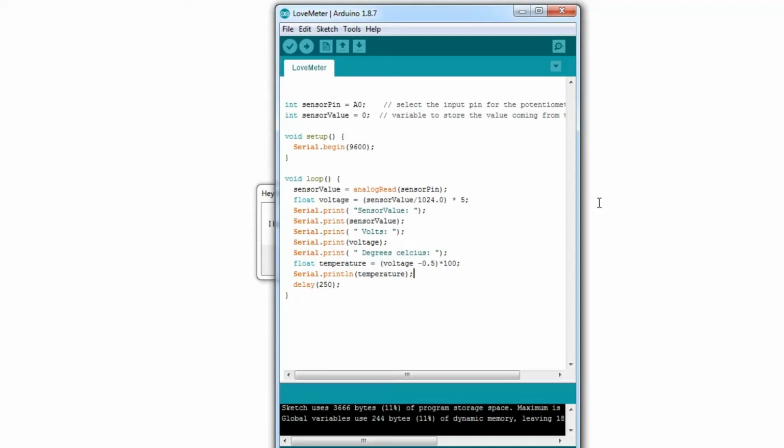They say first of all set a baseline temperature. So we'll set the baseline temperature at about 20. Const float baseline temperature equals 20.0. Actually, I think I'll raise it up to 22 just to be on the safe side. That's basically the room temperature. So what we're going to do now is set up the pin modes, from pin number 2 to pin number 5, and we could do it with a simple for loop.